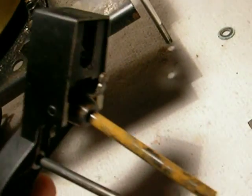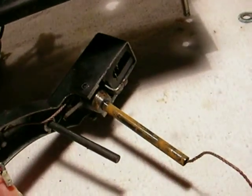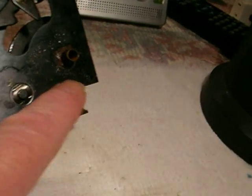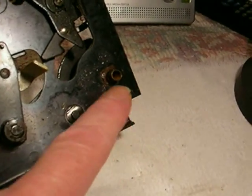This unit has several problems and still does. Notice the rust on the pivot shaft of the tonearm — it's because they didn't put any lubricant on it from the factory and it's stuck in the bore. The only way to get it out is to take the arm assembly off the turntable changer. You can't take it out of the cabinet unless you take the arm off, so it's a bit of a catch-22. What you can do is carefully apply heat with a disposable cigarette lighter right to that point, making sure nothing burnable is nearby. After you get it good and hot, dribble a little three-in-one oil on the seam and you'll see it wick into the hole. Eventually it will melt the rust — it acts as a solvent — and enables you to pull the arm out.